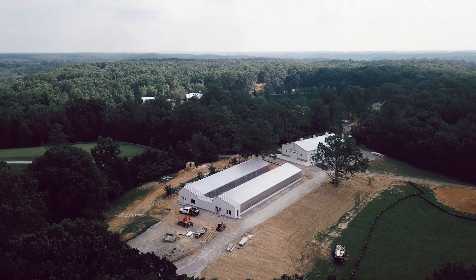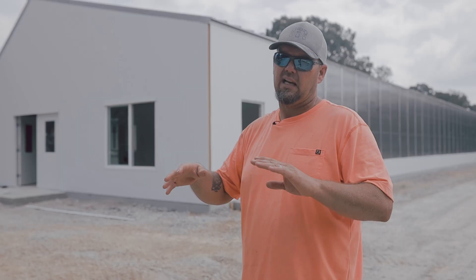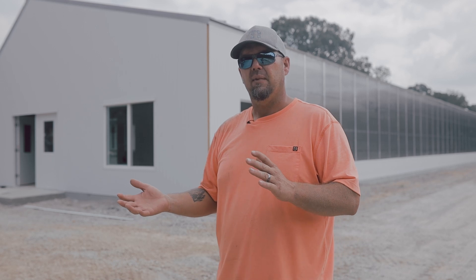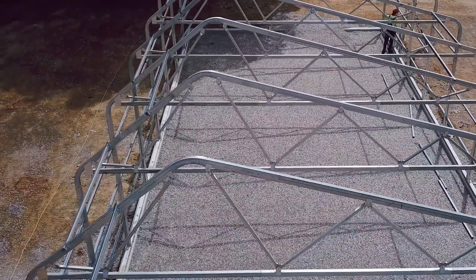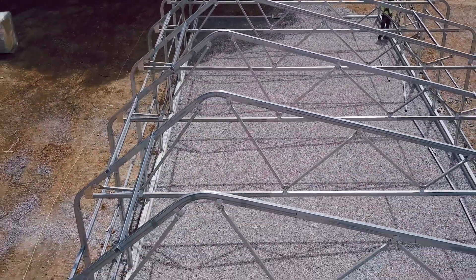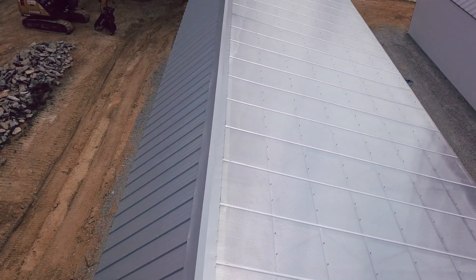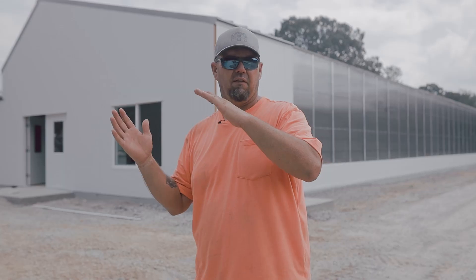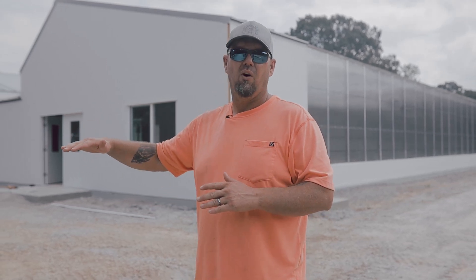A lot of math has gone into it. A series greenhouse always runs east and west, always with a south-facing side and a north-facing side. With a standard traditional pitch breaking in the middle, you'd lose light exposure to approximately 10 feet of the north wall. So instead we use a 3/12 pitch extending 24 feet out in a 30-foot wide greenhouse, then go to a 9.5/12 pitch to give a full spectrum of light four feet up the north wall.